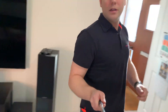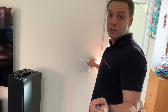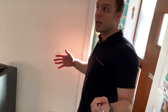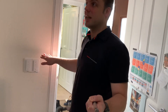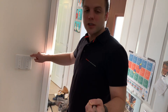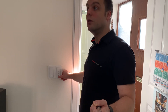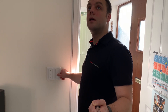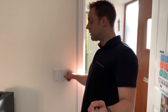My Hue hub is right here — let's unplug it. Power's gone. Let's go look at my light switches and see which functions still work. I can't turn the lights on anymore. If these lights were off, that would be that. If my Hue hub was broken I'd need to buy a new hub and reprogram everything — not good. I can't access the circuit anymore because I've stuck the switches over it intentionally. Can we turn the lights off? No. Does the dim command work? This should be just ZigBee straight to the lamps — nothing.